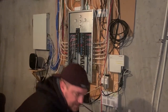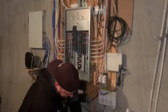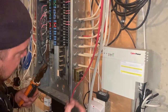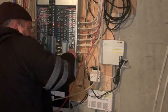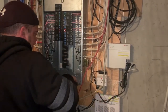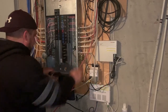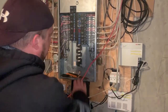Do you have to shut the power off? Nope, not at all. So what we're going to do now is stab the wire into the panel. We need to come through a knockout hole, so we'll look around in here to find one that works for us. We're going to take that knockout out and bring our wire through there. We use a gray plastic connector to bring our wire through. Now, the power inside these panels is all isolated to the bus bars in the center, so as long as we don't touch those we're not going to get a shock — but boys, if you touch them you'd know it.